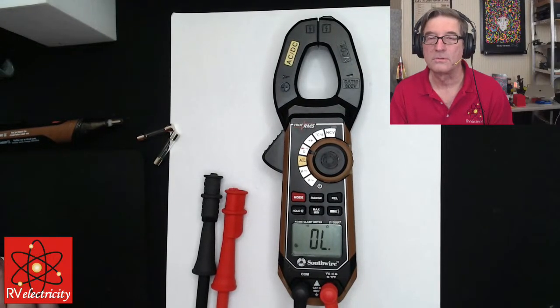Yes. I think if we can talk about continuity a little bit more, because it's a very important test, right? To determine if you have a good connection, a good ground connection. Certainly. So the bottom line is continuity. The continuity setting of that meter is doing nothing but checking that you have a complete circuit. You have a continuous path for the voltage. We're basically ensuring that there's continuity in whatever we're testing. Mike just demonstrated a fuse.